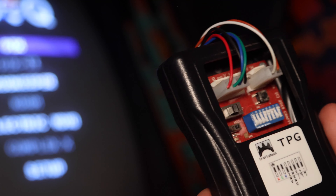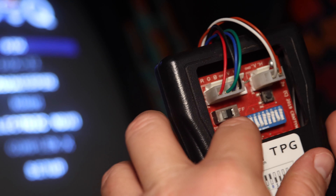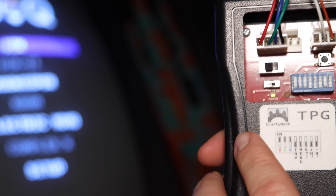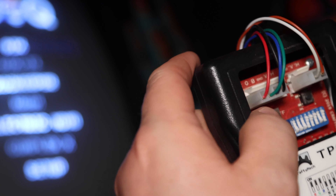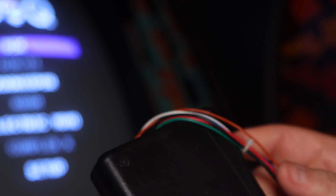When you flip it on, it should have an LED — there's the little green LED. The batteries might be a little low — just a standard 9-volt. It's definitely a cool tool to have for testing monitors and getting them dialed in. I actually used this TPG on the Zookeeper monitor, and the Zookeeper monitor looks really, really great. It allows you to check for color — if your color looks off, it'll throw an RGB signal through and you can determine whether it's the monitor or the PCB, since you can have issues with the PCB not kicking out color due to a cold solder joint or bad connection. It just eliminates the guesswork.